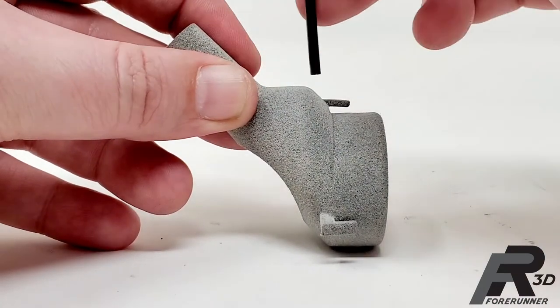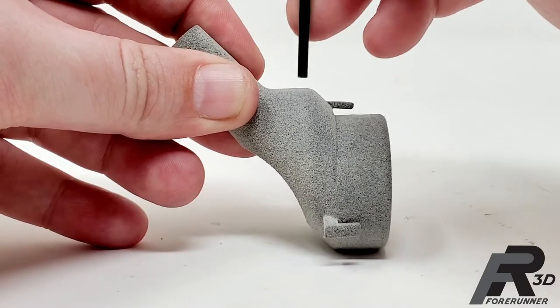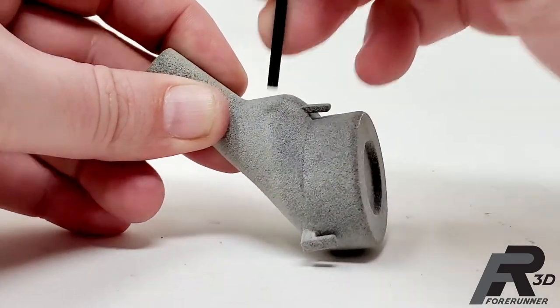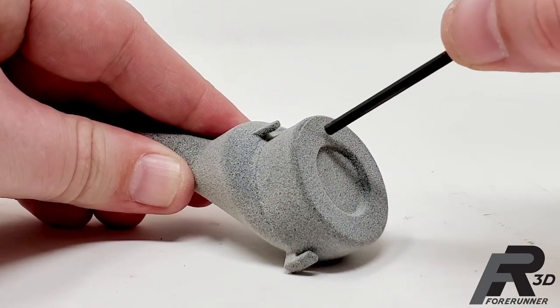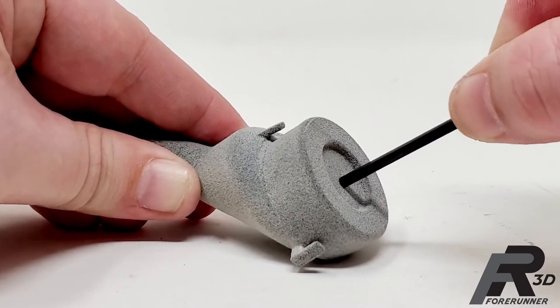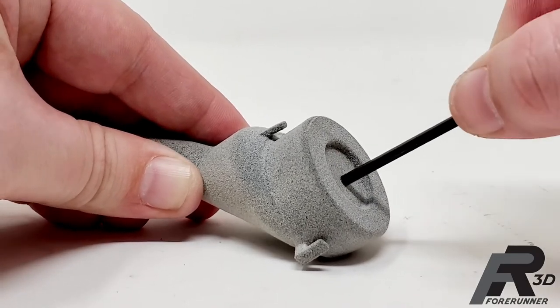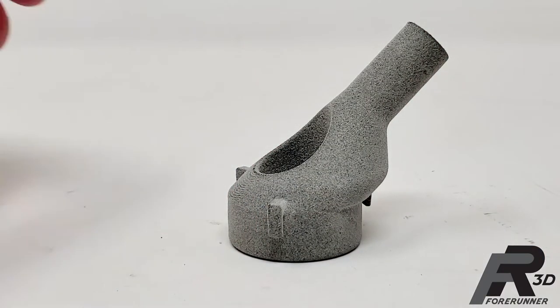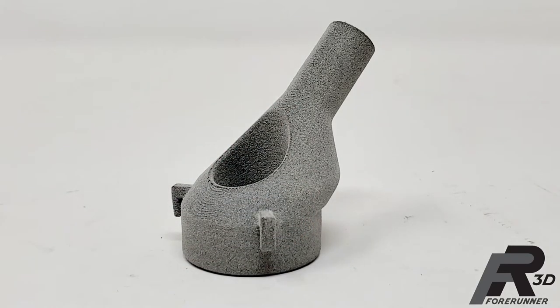But if I come up into the area where we printed it solid, it's not moving at all — totally solid, just a little bit of flex. Same thing down on the bottom; I'm really pressing on it and the tool isn't moving into the part at all. Even though you can't have a multi-durometer with this material — you only have 95A to work with — by designing thick areas and thin areas, you can get some areas to be very stiff and others to be very flexible. It's all about how you design it.